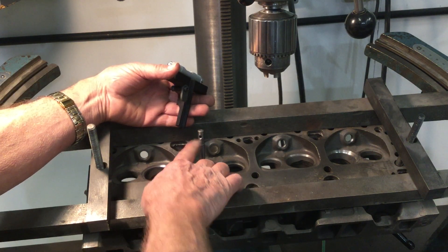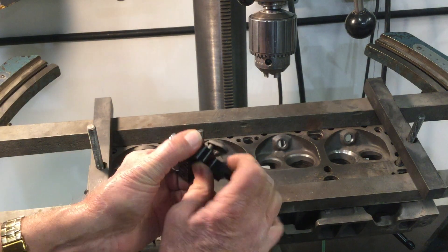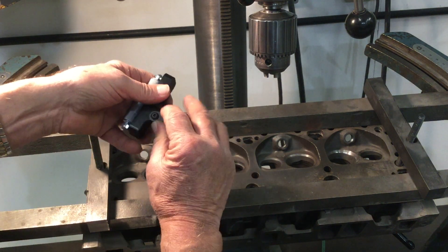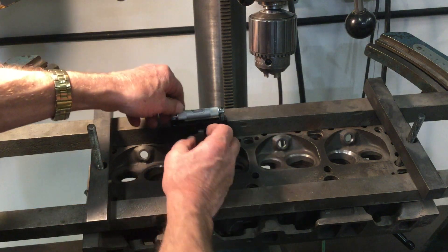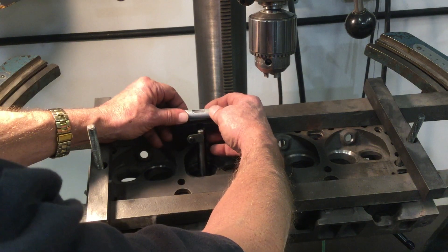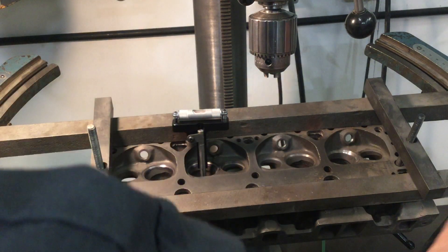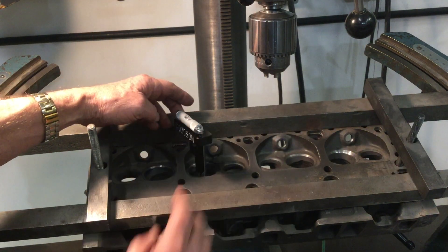The most universal top-size pilot is .375. We've got a spring-loaded lever here that allows us to have access to that V-channel, and then we simply clip that around. It's got a protective aluminum body. That's a Starrett vial up there, by the way. This allows us to level the workpiece left to right, as well as front to back.